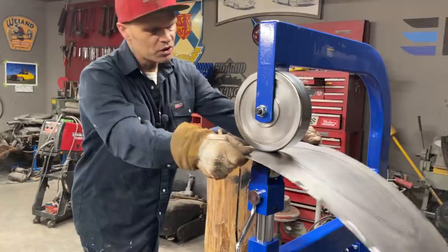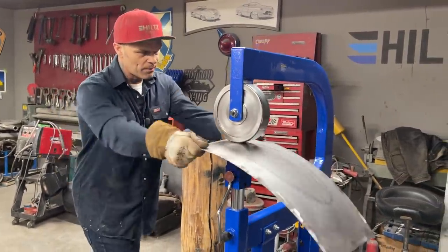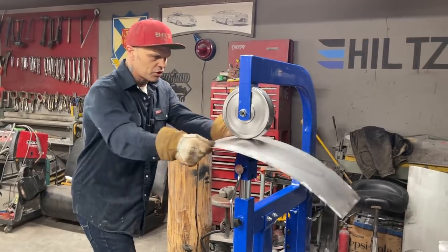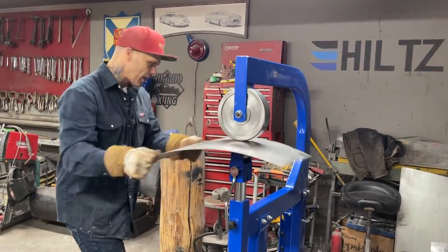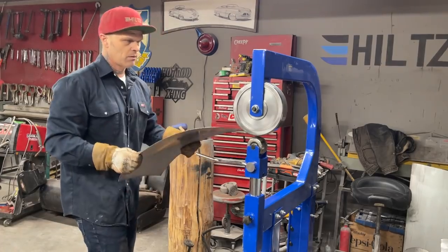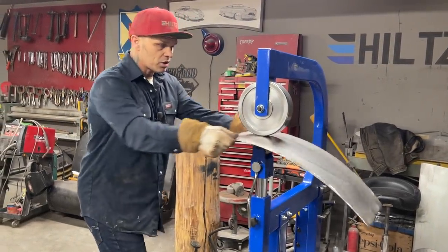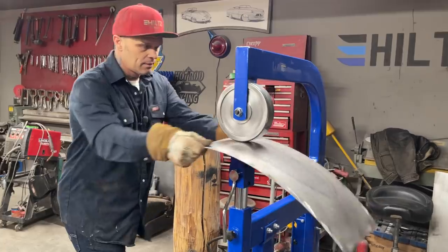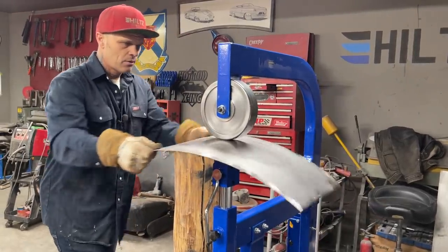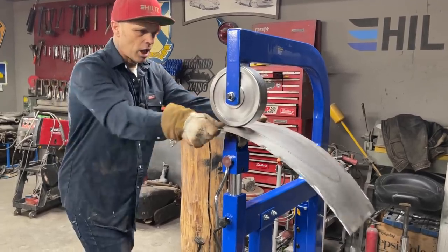And this is not something you do all the time. This is something where you get into where I'm at, you're making something, and you want some shape. That's what the hammer and the bag are for, making shape. Could you see the lines on the camera when I showed you? Good. So you can tell it's really cutting. We're making shape, stretching the metal, making shape.